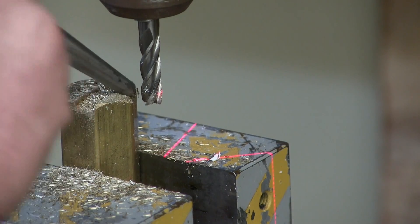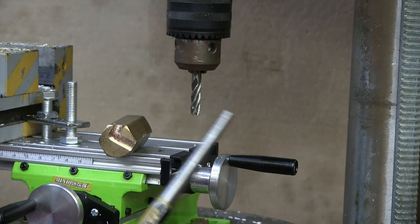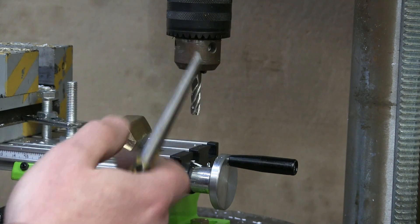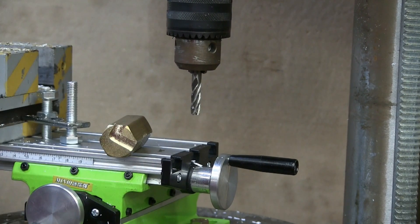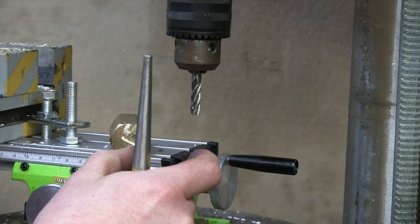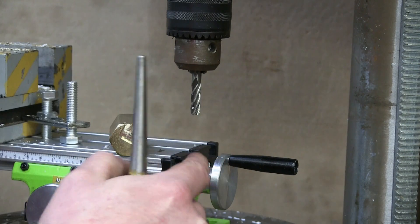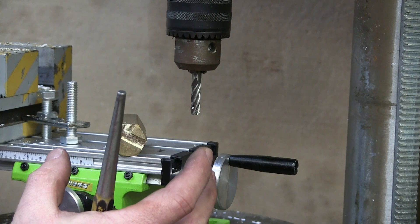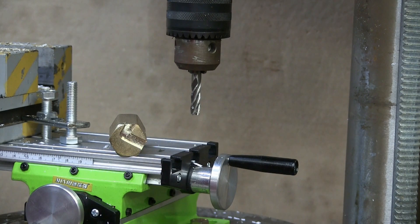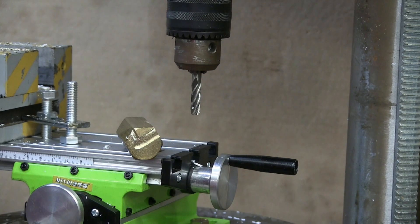If you didn't have a milling machine, I'd say that's pretty fun. Thirty-some dollars and a quarter-inch end mill — that's a win in my book. I can't wait till we get the proper collet. It's a fun little toy, essentially. It'd be good for doing slots in thin-gauge material — it's tough to drill when you want to slot something out. Also good for doing enclosures: zinc die-cast, plastic, even brass. If it can do brass, it'll do aluminum. Once we get the collet though, look out.